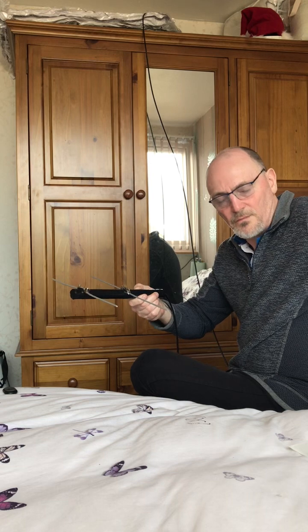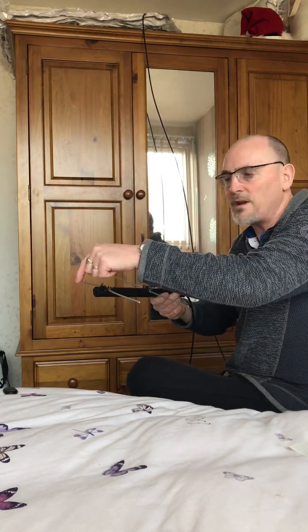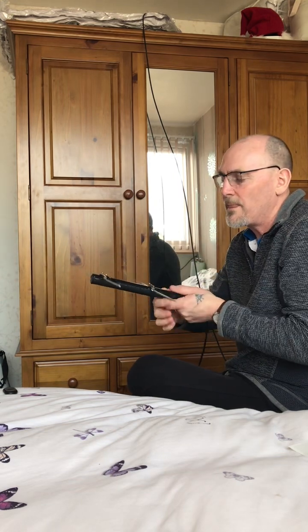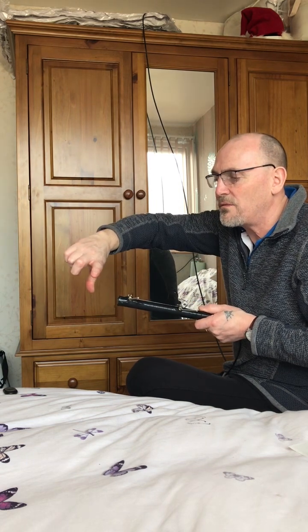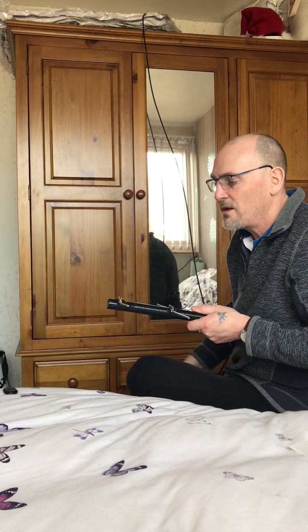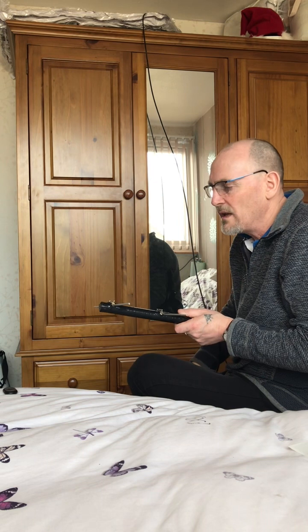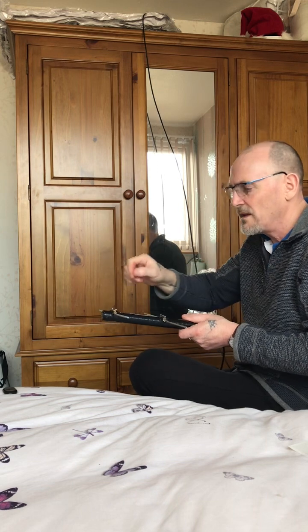Now what Mr. Uda and Mr. Yagi found out was, if you added more elements in front of this driven element, this half wavelength, and each of those new elements was slightly smaller, going all the way along, your beam got narrower and narrower. A bit like, until you can end up with it a bit like a surgeon's scalpel.